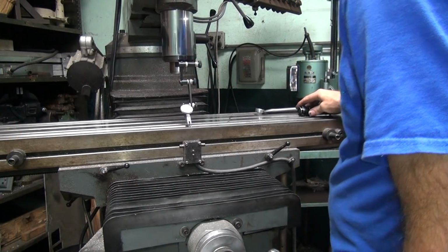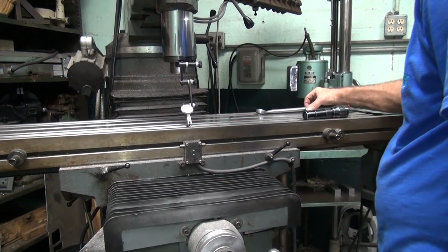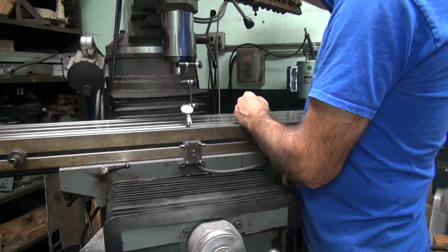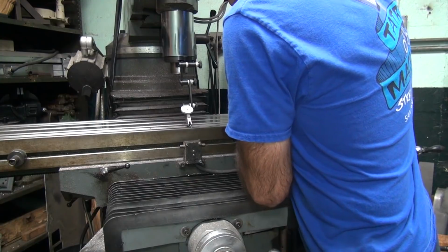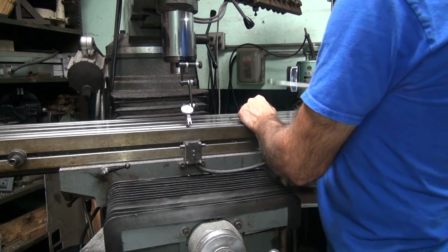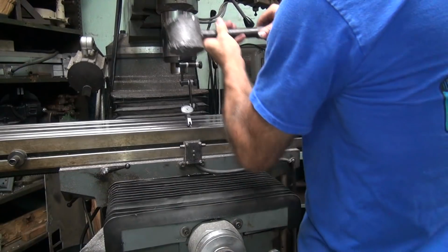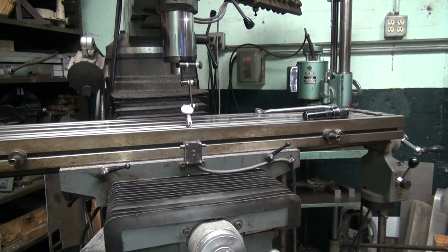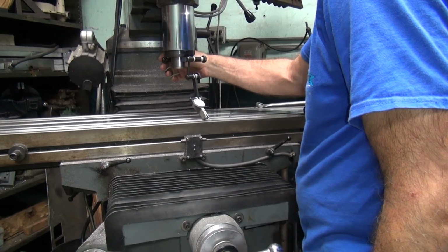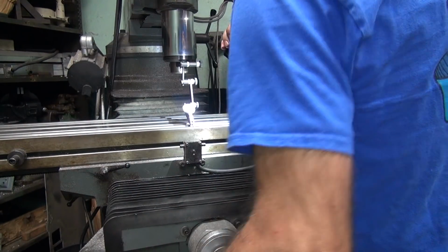Okay, so we're a couple tenths up on the back side, so now we're too low. We went too much. So you only got to move it 1/10 probably to square it, but things don't move 1/10 around here. You got to work on them. And once again, I can't see what I'm doing, so I'm just going to guess. I went the right direction, but I went a couple tenths, which is going to be too much. Give it a little bang bang. There's 0.